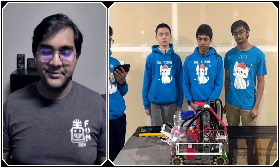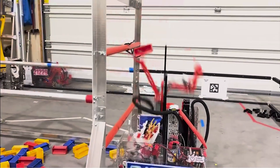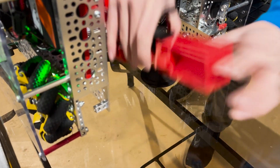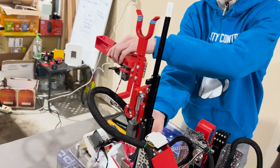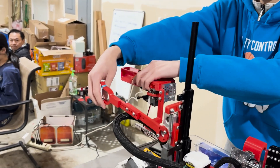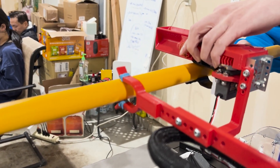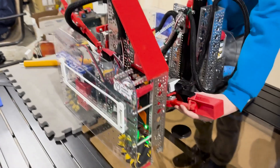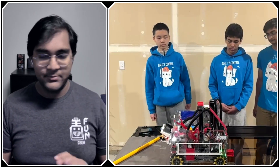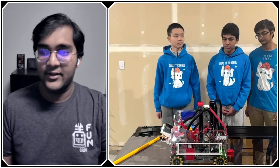One of the most unique things about your specimen deposit is the alignment mechanism. After we intake the specimen in the back of the robot and flip over to score, we realized that having one slide meant it could wobble a bit. So instead of just suffering through that, we built an alignment arm which contacts the bar at two points, so it can score really reliably without any wobble. Normal PLA works really well for us and it actually never broke during the season.